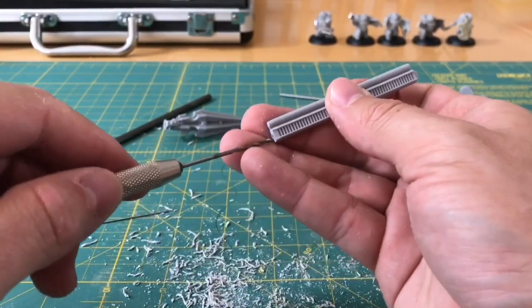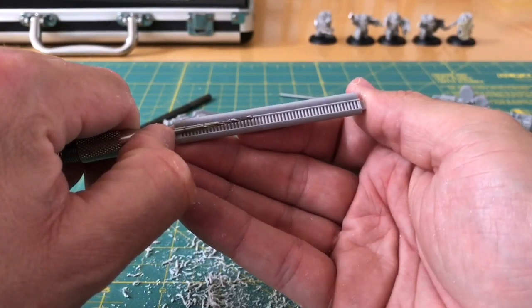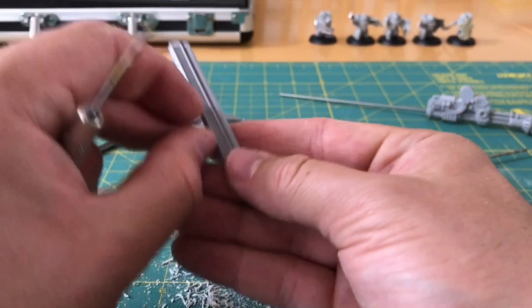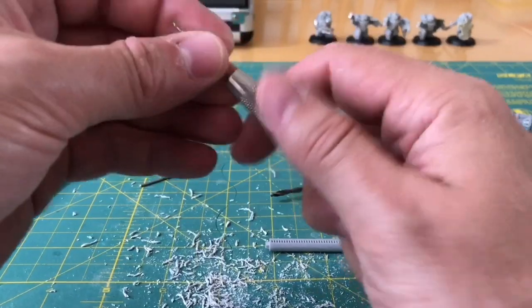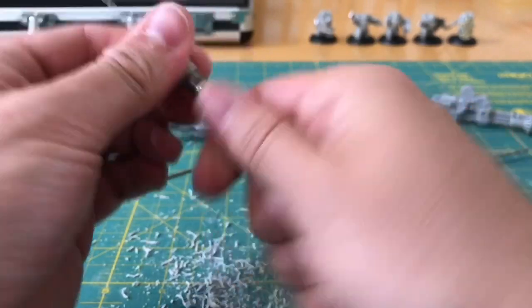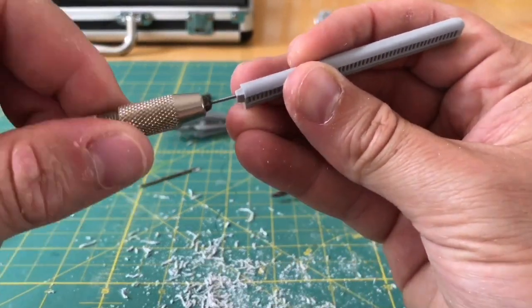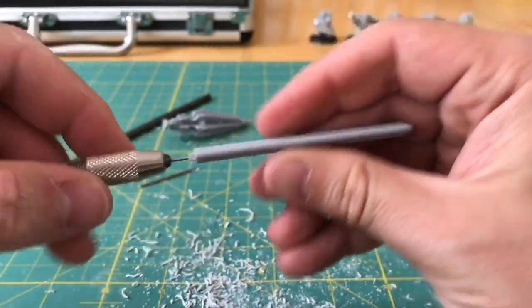I've done a bit more - let's see how much progress we've got now. That's pretty good - we're about almost halfway there. On this side there's still a way to go, about that much left. I think I'm going to change to the smaller drill again. Now we're deeper in, I'm finding the going with that thick drill quite slow. I think it will be beneficial to do some work with this thinner one now. I've got to be careful to get my initial alignment right to avoid tears later on. It should now be possible to drill in somewhat quicker again.